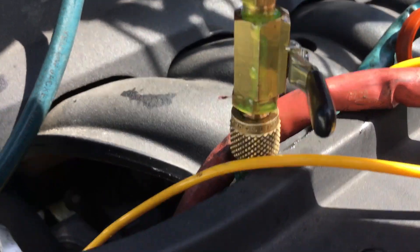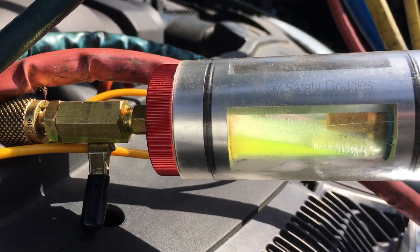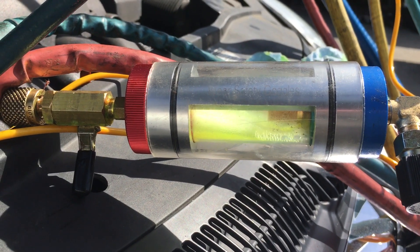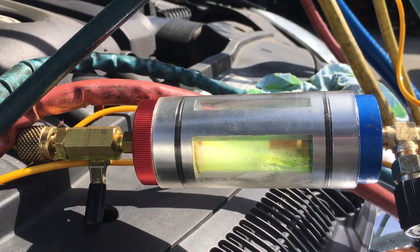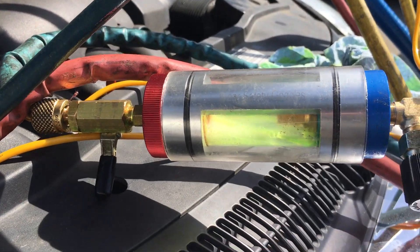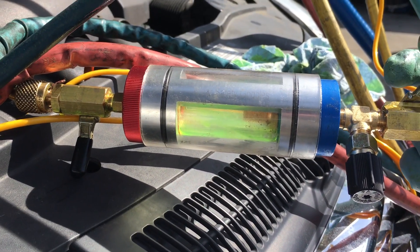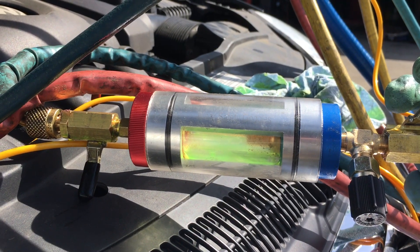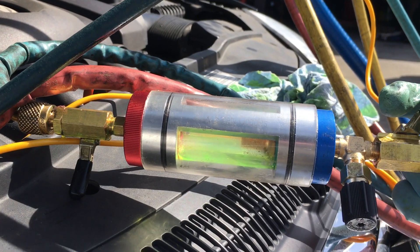I got a leak down there too, on this side of the valve, so it's actually losing a little refrigerant right there. But you can see it's going down. Let's see if I could lay it over without touching the filter — I don't want to suck it up inside. If you remove the vapor of the refrigerant off the top, the oil doesn't come up and gets left behind. If you took out, let's say, 100 grams of refrigerant, it would have oil in it — right? You evaporate off all the refrigerant and you leave behind the oil. Let's say we had 100 grams of refrigerant, we boiled off the 100 grams and were left with one gram of oil — so we had basically one percent oil mixed in with the refrigerant.